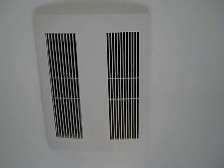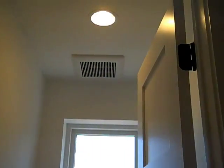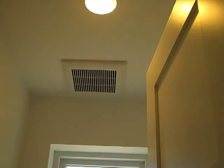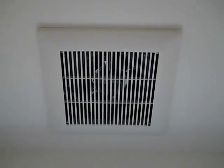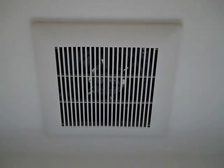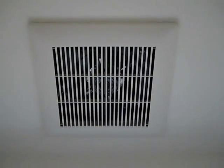Let me turn that off and turn on the heater fan. These are basically a resistance heater — it's kind of like having a hair dryer in your ceiling. Here in Texas we don't use those a whole lot, except for a few days a year when your bathroom might be slightly chillier. They're nice to have, not super expensive, and they do provide some auxiliary heat. The other fan we use a lot is this Panasonic Whisper Series fan, which is very, very quiet — probably around 0.5 sones, even quieter than the other one.